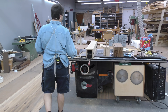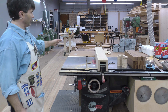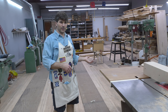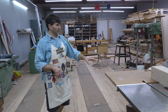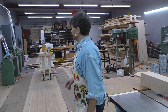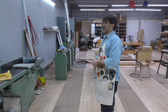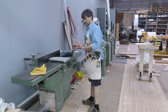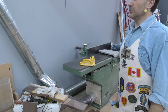This is the center of our shop. This is my SawStop, which I think is the greatest saw you can buy. We have yet to build the extension table — this is just an old door. We moved things in here while trying to leave one shop, get this one up and running, and keep production up at the same time. We'll make a nice extension table so that when you're cutting a full-length sheet of plywood by yourself, you don't need three other people. This is my 12-inch jointer. Most of my equipment is General, which came out of Drummondville, Quebec, until they closed about four or five years ago. I put in the segmented head as an upgrade, and it works absolutely fantastic. We run a 6-inch line to that, and nothing comes out of it once you turn the dust collecting on.